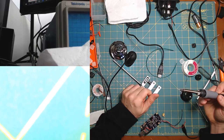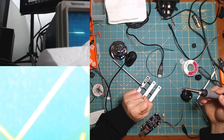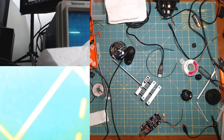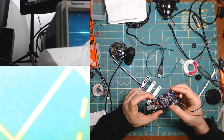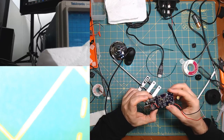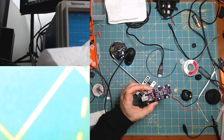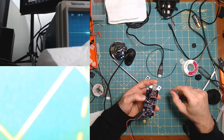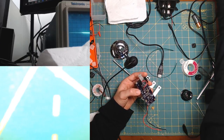Hook up voltage to the battery input and pour some alcohol on the thing, whatever dries up first is heating up, equals short. Oh my God, that's brilliant. I think I might, would that really work? Yeah, I might try that actually. Okay, sorry. Yeah, thanks. Don't know what was going on with the mic. That's an interesting idea. I do have some alcohol here.